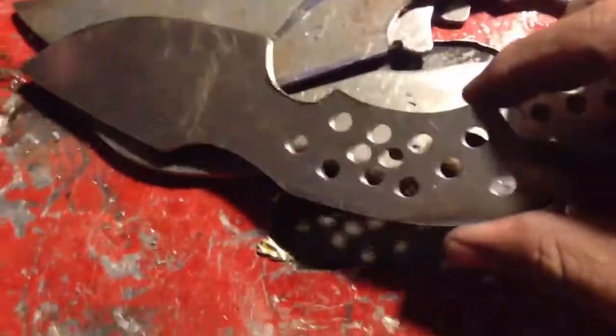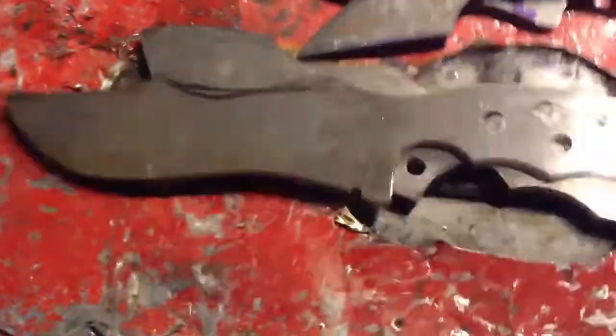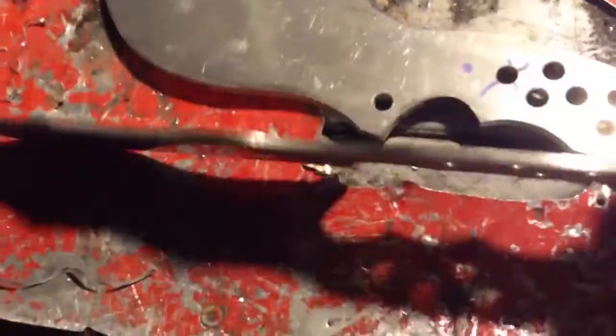The holes here are drilled to line up the blade just enough so it will balance perfectly once you have handles on. I didn't drill too many to keep the structural integrity of the blade. On this one I drilled quite a few; this one just a few. But this one is thinner — this is 8 inch — so I only did four weight reduction holes because it is thinner and it will actually flex a little bit if you put it in a vise. The blade is longer too, so you do need a little bit more weight on the handle, so I don't want to do too many holes on that.